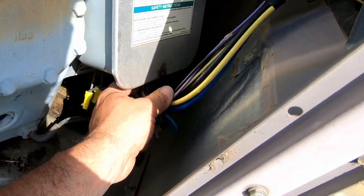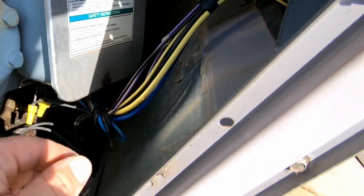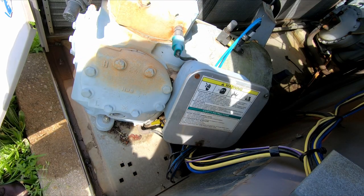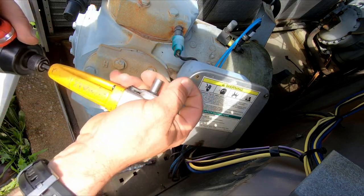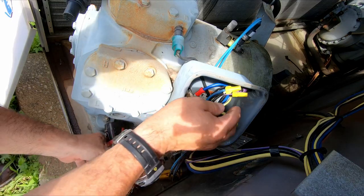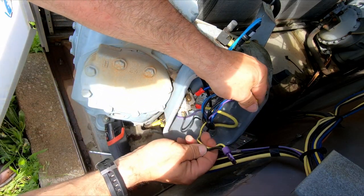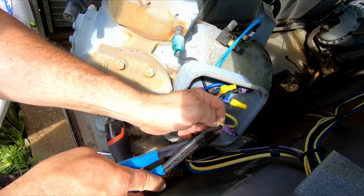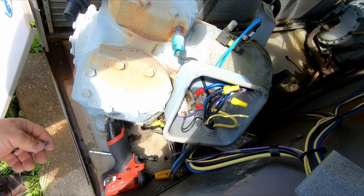We'll have to go to one of the heaters here and isolate it, which we've got some right here. The actual junction of that yellow wire is right here coming in - we could always chop it right there if we didn't want to dig into there, but that wouldn't look very professional. Let's do this one because it's closest, but probably won't be this one. There it is - there's that crankcase heater going to the black wire. What better way to find out than to snippety-snip.